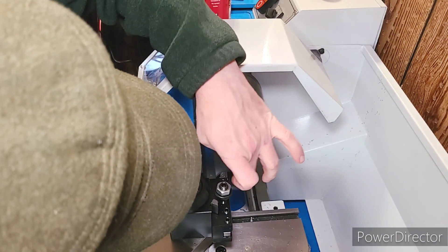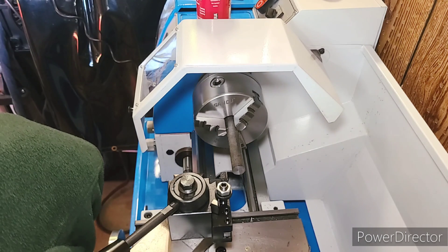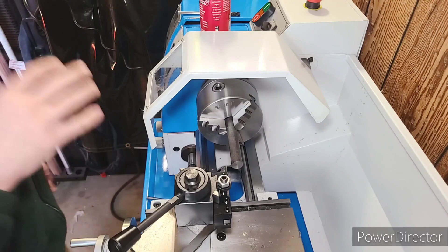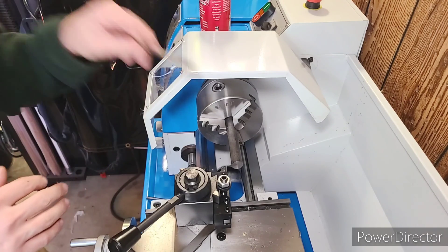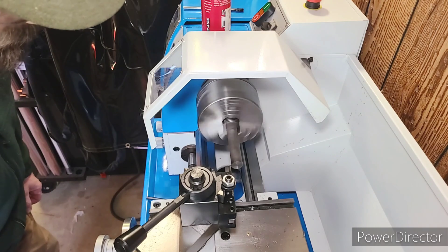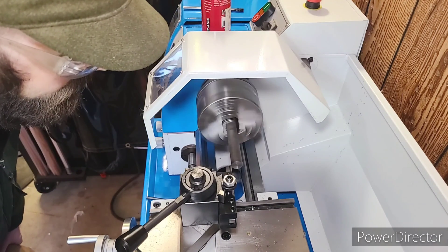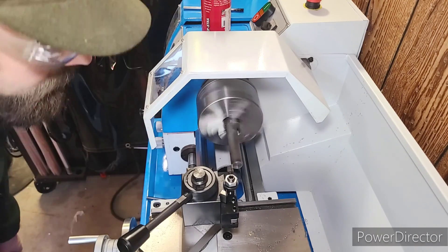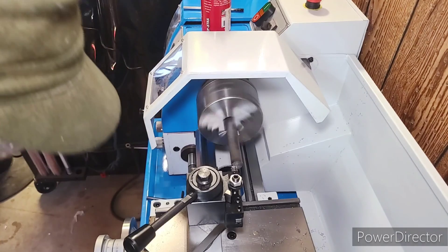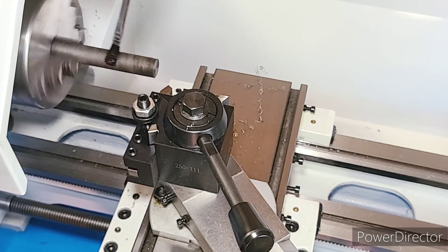Looking at our cut, there are a little bit of markings in there — inconsistencies with my cutting — but hey, it looks pretty nice. Not too bad. Let's go ahead and give the power cross-feed a try. I'm going to bump the RPMs up just a little bit, give it some oil, and we'll engage that cross-feed and see how it goes. Not a bad finish, I don't think. Next we're going to use a left cutting tool and go ahead and machine off the face of this and give it a nice finish.